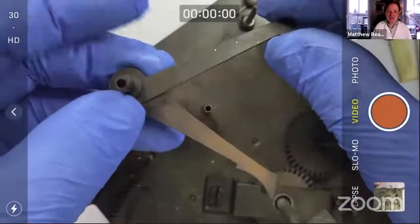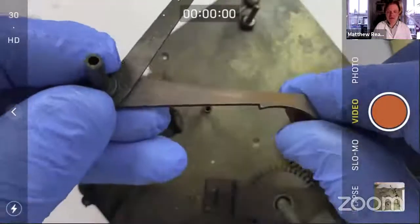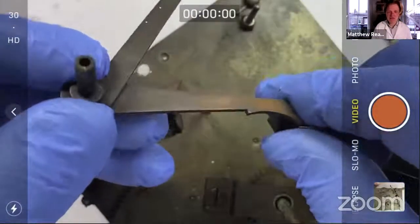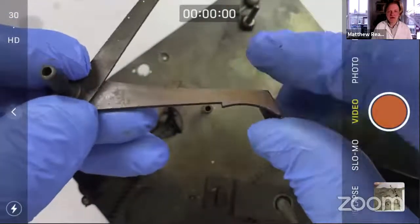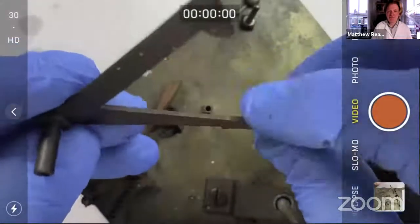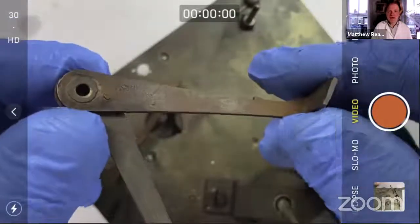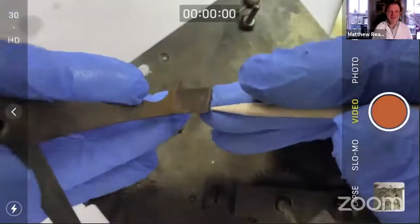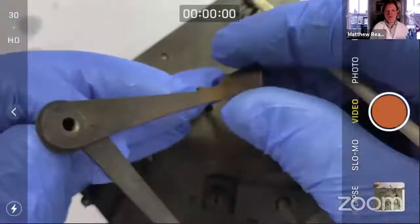So what I'm gonna do now is, this is our first component off, and you can see, actually just handling the rust is really insignificant. This is gonna clean up beautifully. I will try and get a little bit of this off, but once it's been in paraffin for a good old scrub and a little bit of steel wool, maybe 4-0 steel wool, this is gonna be absolutely fine. Again, just to climb on the soapbox again, just climbed off it a few minutes ago,